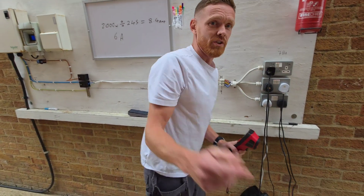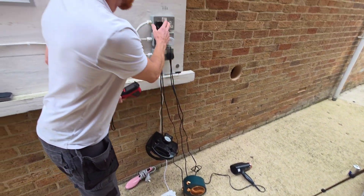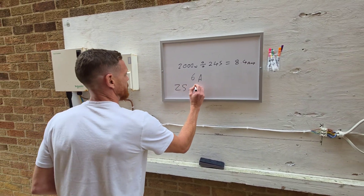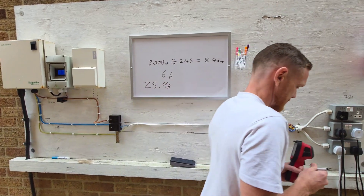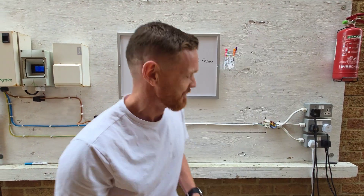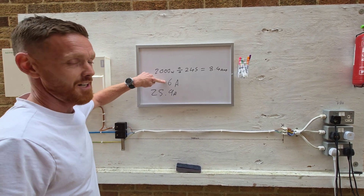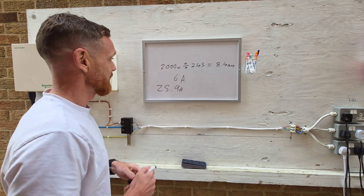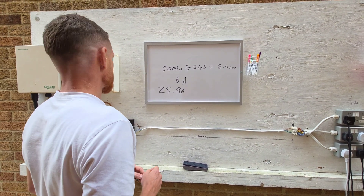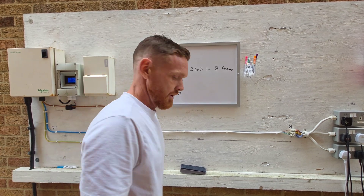In conclusion, with all this equipment running — around 6200 watts — we had 25.9 amps going through that cable. The cable's rated for only six amps safely, though there is always a large safety margin built into those numbers. Turning everything off now — nice silence.